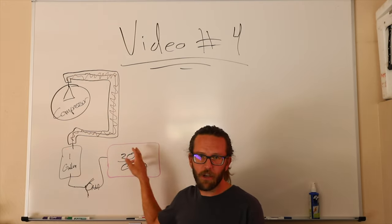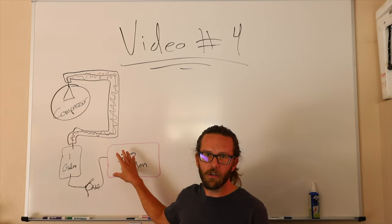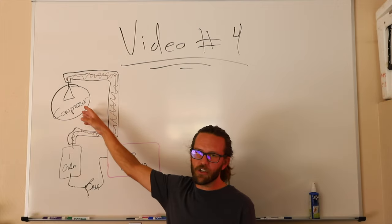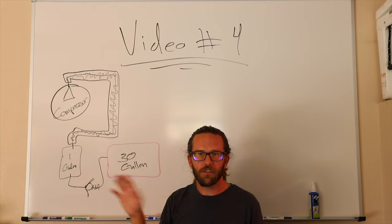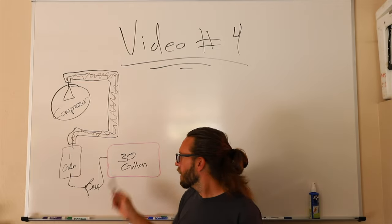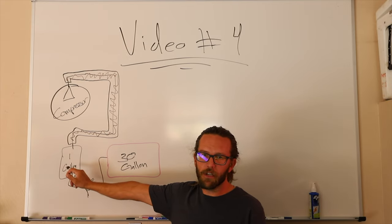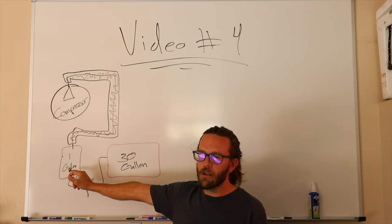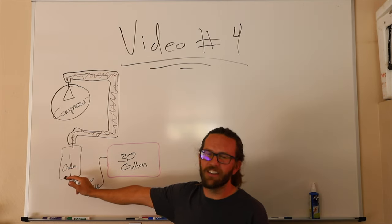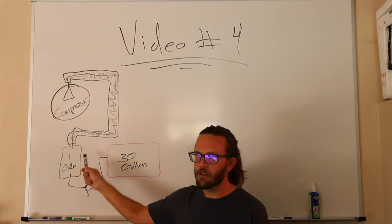In between the bounce tank and your main pressure tank, you have a check valve. Because of that relief, it'll vent out your entire system if you don't have this check valve. Literally, if you shut it down, till it's ready to load again. The check valve is very important. You probably don't need a bounce tank if you're... Let me take that back. You definitely don't need a bounce tank if you have an electric compressor. You just don't need one. Your compressor is not running all the time. It's only for gas compressors.